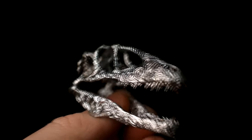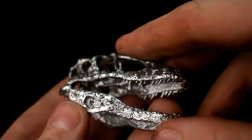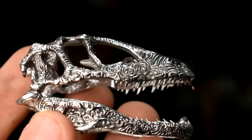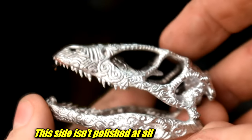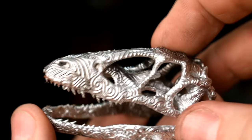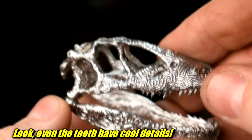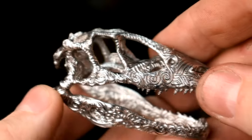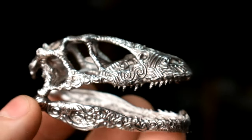Next time I'll probably make something that has a greater purpose than just looking cool — hopefully it also looks cool. Maybe it'll be big and sandcast. If you want to learn sandcasting using your 3D printer, there's a link for you down below. All the equipment I talked about in this video is also in the link below in the pinned comment in the description. If I were just starting to get into this investment casting thing, I would get the Uniformation printer and wash/cure station as a kit — they come as a kit. And then I would get the vacuum casting machine, because you can gravity pour this stuff, but for this kind of detail you really need the vacuum. For these waxy, goopy resins — and even for tough resins — that ultrasonic cleaner is really awesome. It makes it almost as easy as normal plastic resin. Almost. Not quite though.